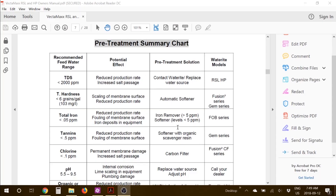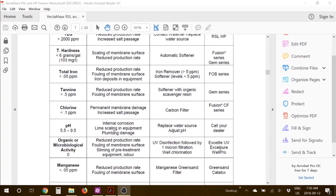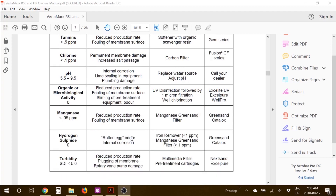With this pre-treatment, obviously you're going to have to plan the space for that. If you have a pre-treatment like a water softener you have to allocate that space, but also the storage tanks for the water — if you're going to an atmospheric storage tank and then re-pressurizing the system, you have to plan for that space. There's also some post-treatment: if you're going to use this for drinking water or household water, you're going to need to install an ultraviolet disinfection system after the water has been re-pressurized to service the house, because whenever you store water in a tank there's always a risk of introducing bacteria, and that's why you need ultraviolet after this system.